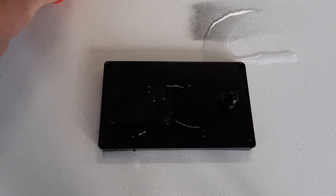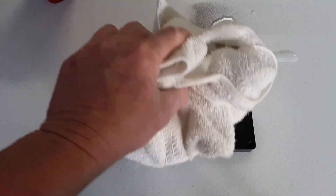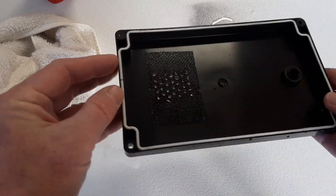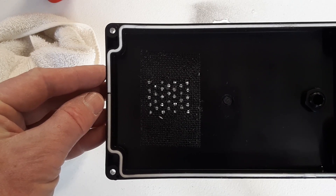I'm going to do a first test with just the lid, not the full box with the PWM, just to see if it's going to work. I've got my cup here with some water and I'm going to simulate a splash — just like that — and leave it sitting on there for a bit. If this happens in real life, turn your PWM off and don't rub it dry; take something absorbent and just blot it, because if you rub it you might push water through the screen holes. It's dry underneath.